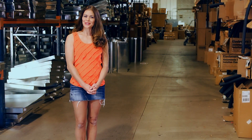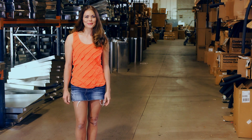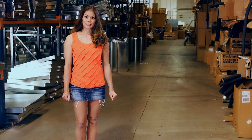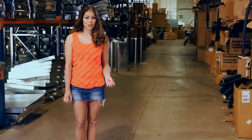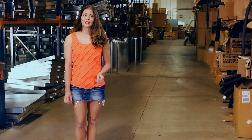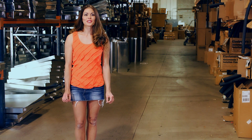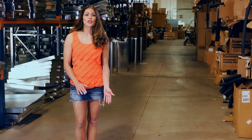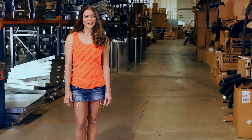Hi, I'm Arloa and welcome to Color Touch TV. In this episode I'm going to show you how to update the firmware on your Color Touch. Now there are three ways to do this. The first way is to update the firmware directly on the Color Touch. The second method is to update the firmware remotely using your Skyport Cloud account. The third way is to use an SD card with either the Color Touch Assistant or download the firmware manually off the website. Let's get started.